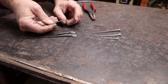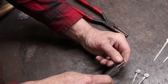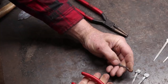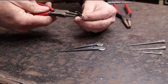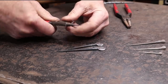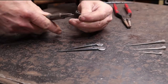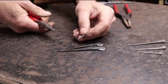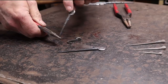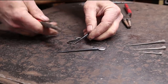That's really all the hot forging that I do to these. I'll probably run them through the forge one more time just to color them. I like to put a little curl on the end and you can do that cold with this little pair of round nose pliers — I think this pair I got from McMaster-Carr, they're an industrial supplier. For the little hook, this is really all you need to roll that hook up. Just pay attention to how it's going — it may kink just a little bit if you don't pay close attention, but that's pretty much a hook right there. I'm rolling away from my step here in this first bend.